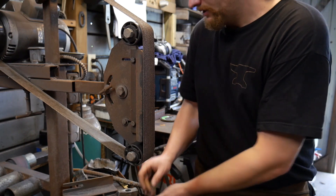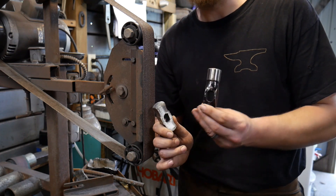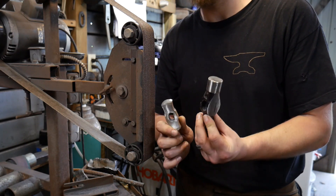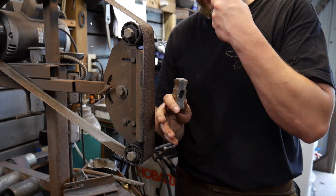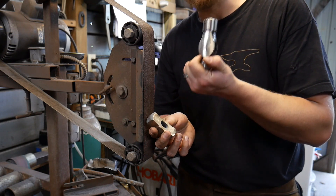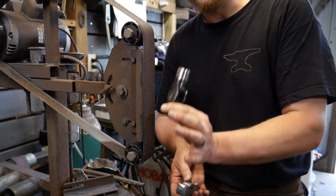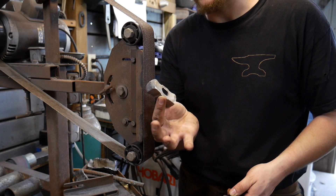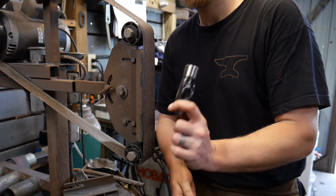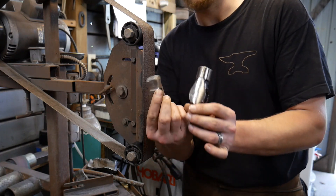As you can see, this hammer I made is about the same spark-test-wise as the factory hammer — they were almost identical in sparks. The amount of cracklers in volume was very similar, so I can ascertain that this hammer is probably made from a very similar steel as the factory one. I bought the material for mine, so I know what it is; the factory hammer is already a ball peen.